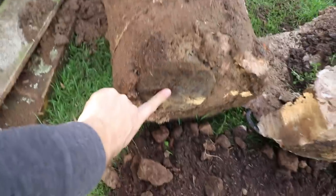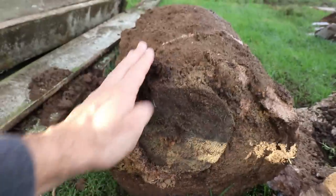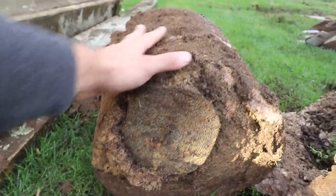So that's the bottom of the post where it contacted the ground, and this is one of the sides. You can see there's very little concrete around here, and no concrete here. Because the strength of the wall is lateral, when you pour concrete for a retaining wall you really need to get a lot of it underneath your timber posts to prevent that post from sinking. So that could be one of the key things on this wall.